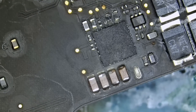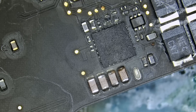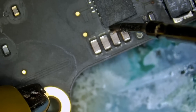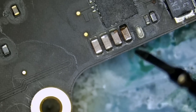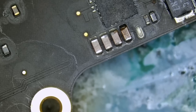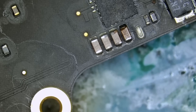We only have corrosion on this area of the board, so why look elsewhere? Injecting voltage right over here — it looks like the flux melted on cap number one, you can see the discoloration. I'm only injecting about 1.2 volts. If I go higher we'll see a bigger difference, but right now I can already tell cap number one is sweating. We got it — we got the bad guy!